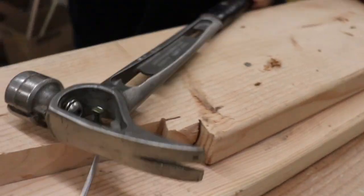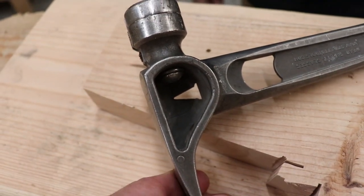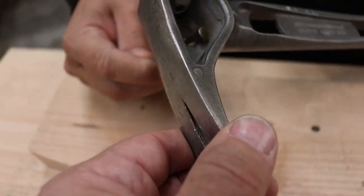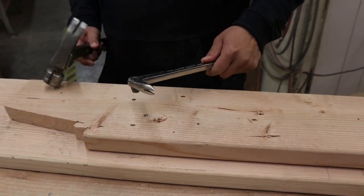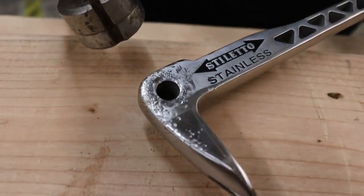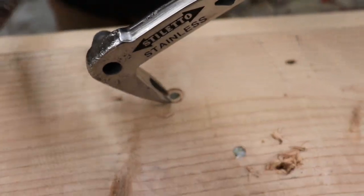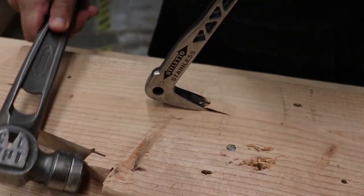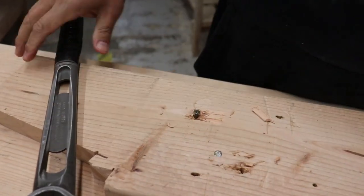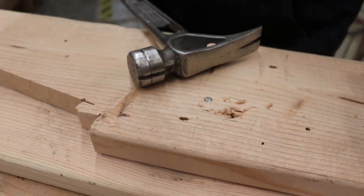That's going to be really tough — this is the one where I would roll the hammer head over. He's got a fancy attachment on his hammer — it's a little notch that sits inside the shank and lets you grab the nail head and pull it over. A two-hundred-dollar hammer pays off. For another one, you use this round part here — the cat's paw with its sharp point — get behind the nail, dig in there, hit it, and get it starting up. Then take the hammer, lock it in, and pull.